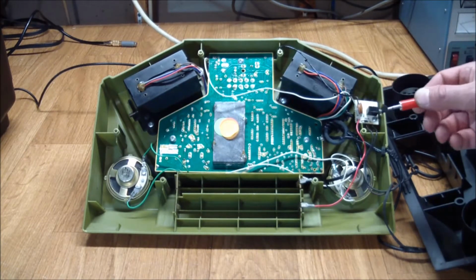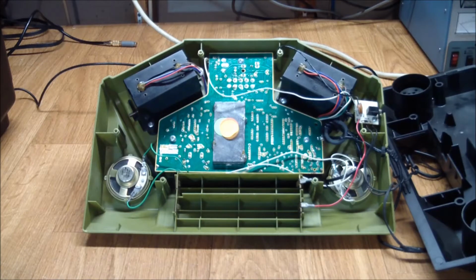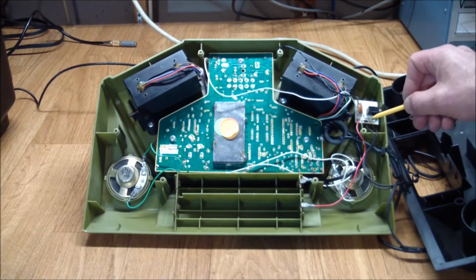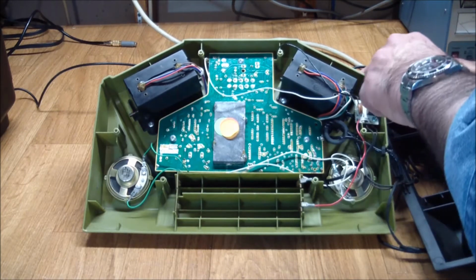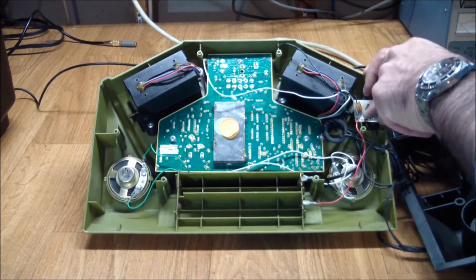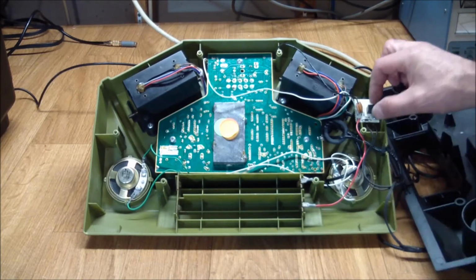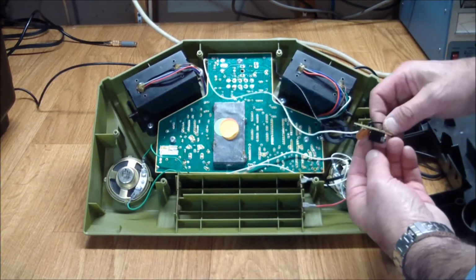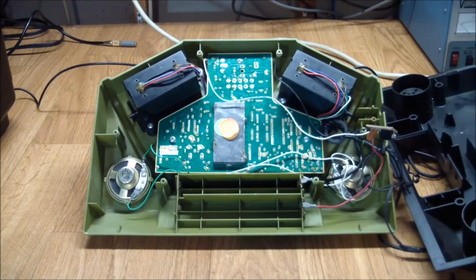Uses a 3.5mm plug normally, but what they did was they probably broke the plug on the power supply, and they just, after a trip to Radio Shack or whatever, wired it directly to the power PCB. And let's have a look and see what is underneath here. Not much on the power PCB. There's a diode and 2 caps, but if we take this out, yes, we can see that the wires are soldered directly to the power PCB board, so it's probably a good place to measure what sort of a voltage